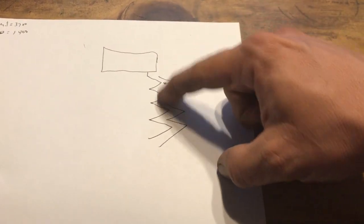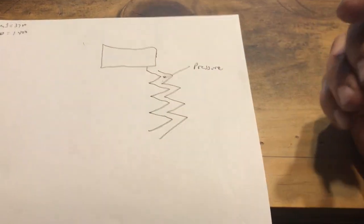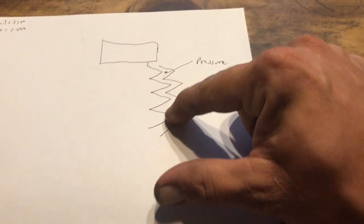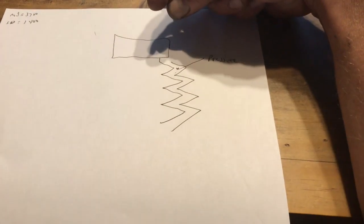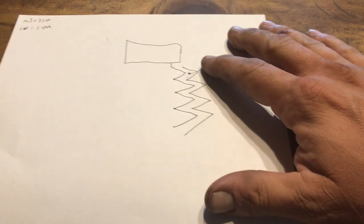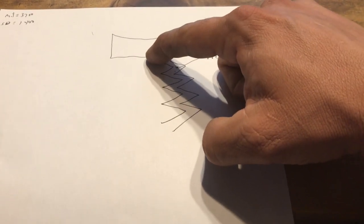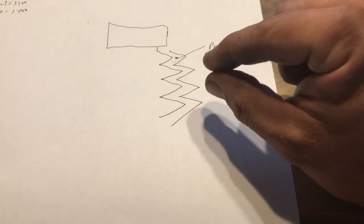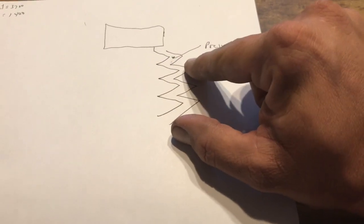You twist this and it gets tighter, and that tightness is the pressure. The tighter it is, the higher the pressure, and then there's a pressure overload point where the threads would start to strip. That pressure can be overcome one of two ways: one way is by twisting the fastener with more force than that pressure is holding at; another way is to vibrate the bolt with enough vibratory force that the molecules between the bolt and nut actually create their own space because of the vibration, effectively decreasing that pressure.